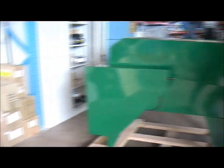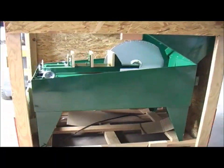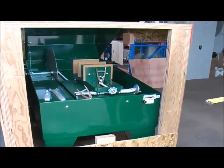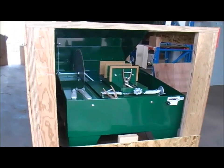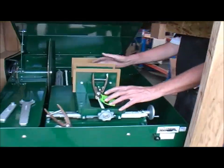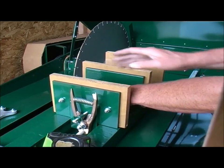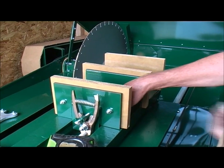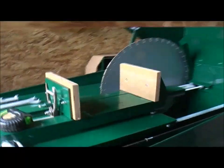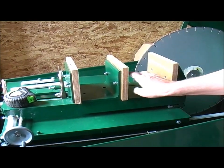So we go from 20 to 24 — this is a 24 inch Covington machine. Very good saw; we've got several of these out with clubs around Australia and they're getting very good cuts out of them. The vice has got a false smaller section. It comes with that false smaller section — I'll just take that out to show you the bigger area. There's just two bolts that hold that false piece in, so you just remove that. You've got that whole depth of vice if you wish, or if you wish to work on smaller products you just bolt that back in and use that surface.